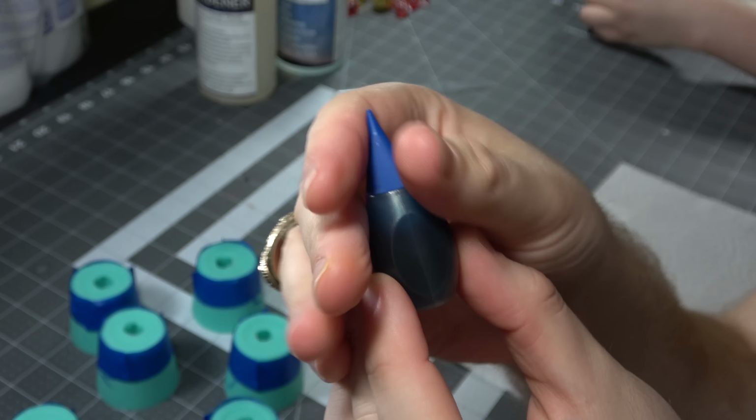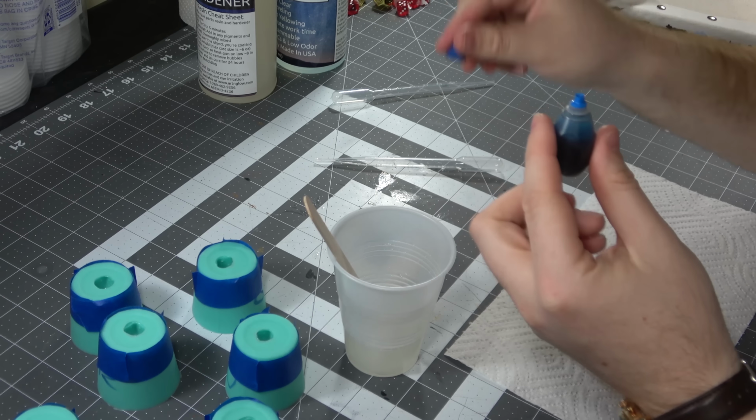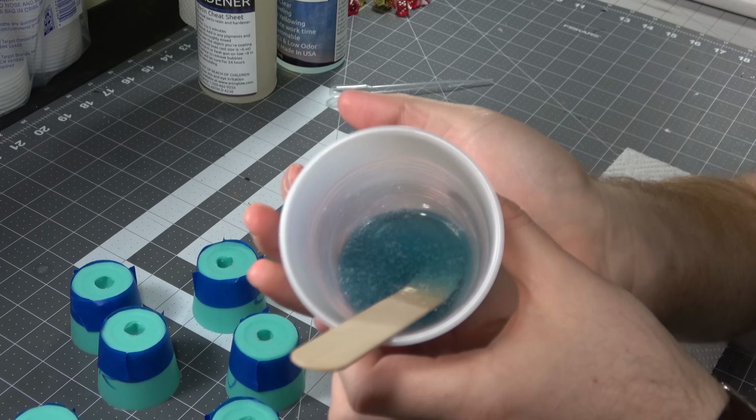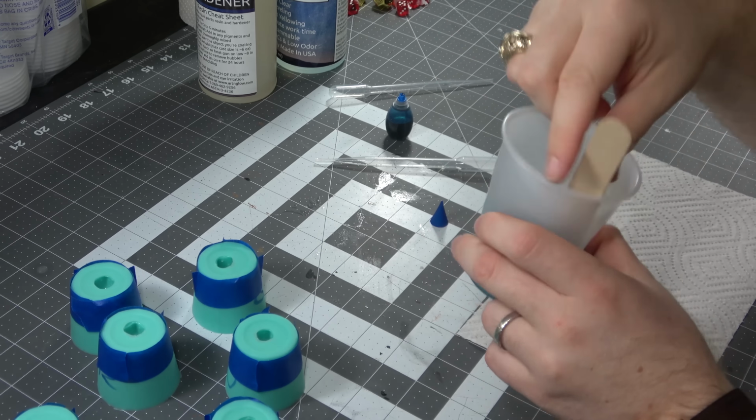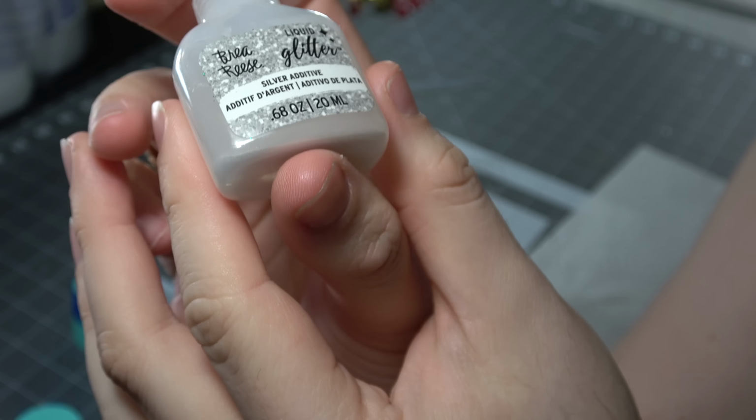Here's my secret weapon for transparent dice. I'm sure you've seen these before. They're the little water-based food dye. I put 2 drops. That is enough to get the color that I want, and any more might actually uncure your dice and they'd become tacky because they're water-based. Everyone will tell you don't do that, but I don't think it's a problem. My dice came out fine.